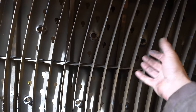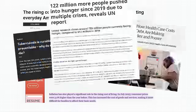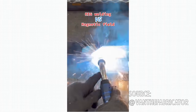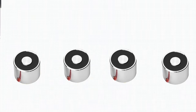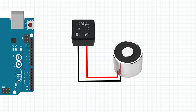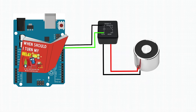And that brings us to the electronics. In a perfect world, all of these electromagnets would just be on a big ka-chunk-ka-chunk switch. But this is not a perfect world — the magnetic field will mess with the arc of the plasma cutter, causing unreliable results. So we need to be able to turn off each electromagnet when the gantry is over top of it. Each electromagnet has its own relay turning it on and off, and that relay is controlled by an Arduino.